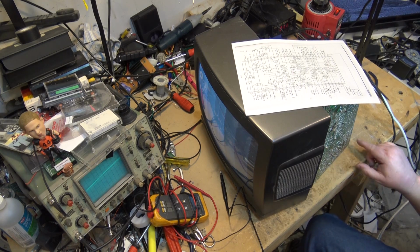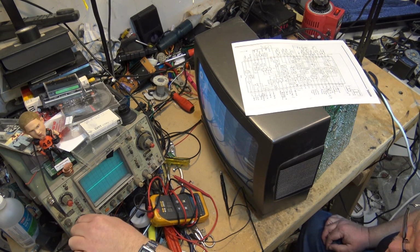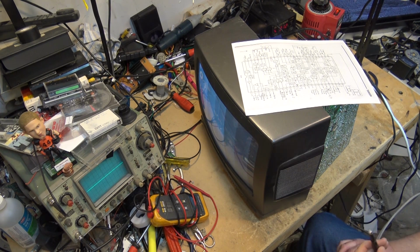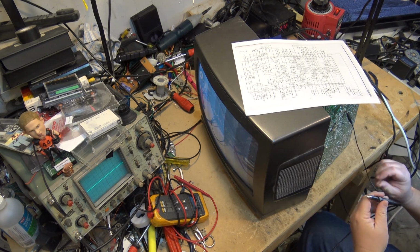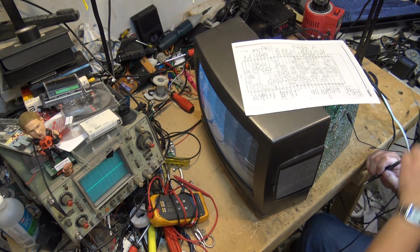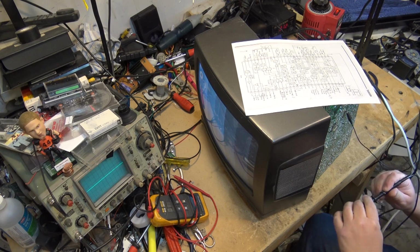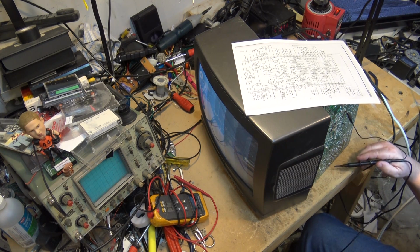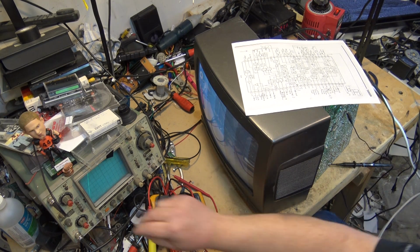There's some very high voltages down here, over 1,000 volts peak to peak. Now, what I mean, I'll show you here on the scope. We'll just turn the scope down. I'm going to crank the gain way up. I'm on a ×10 reference here, and I'll give you an idea of what kind of voltages we're seeing on this thing, because you've got to really be careful if you're working on anything on a CRT television. There's 30,000 volts on the picture tube for one, but even without being on the picture tube, we have some very high voltages. Like down here, I'm on the horizontal output.